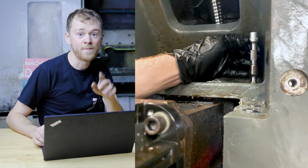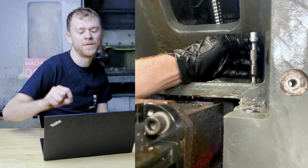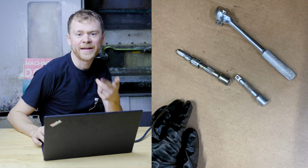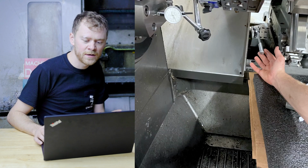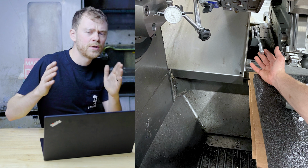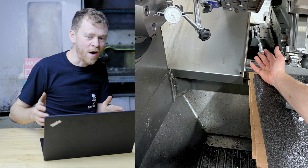Here's another one from the back. I'm looking at the Y motor, that's the X ball screw, and there's a hole I can go through to get to one of those truck bolts. So, yeah, get yourself some good ratchets and some good extensions. So all of that was because I wanted to get the wedge square. But the wedge, which moves in X, sits on Y. But so I gotta get Y square first.